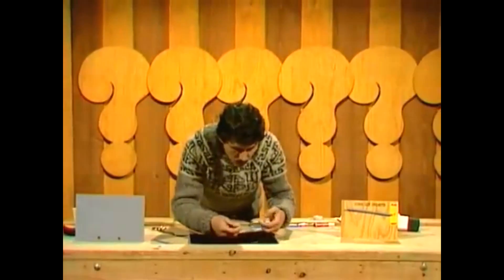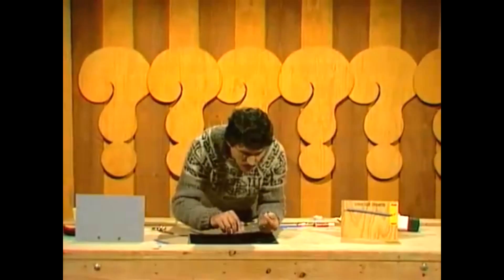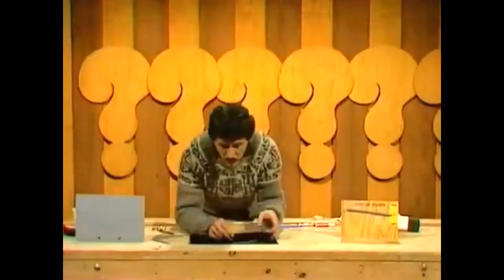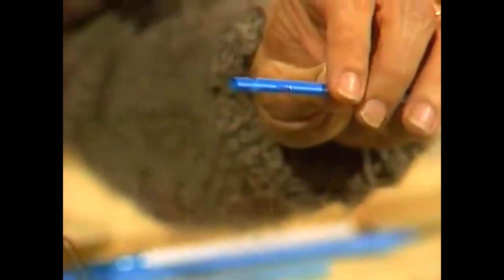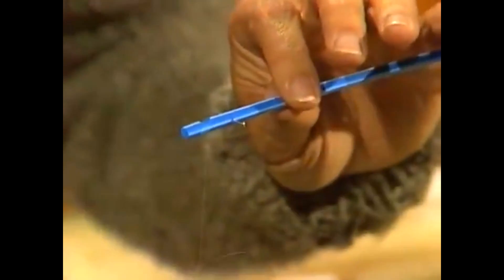It's harder than threading a needle. I've already done it here with these two strands. It took me about five minutes to tie the knots at each end. But you can see what I've ended up with — a long loop of human hair, and this bit sits over that little notch there. Now if that happens to change in length for any reason, you can see that it will pull down on the arrow and make the other end go up.